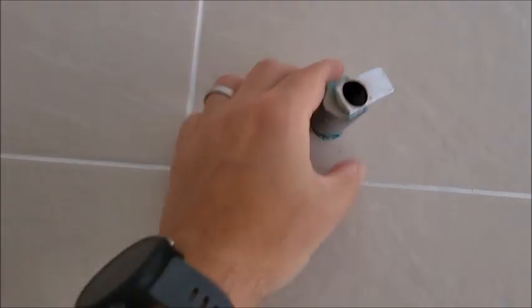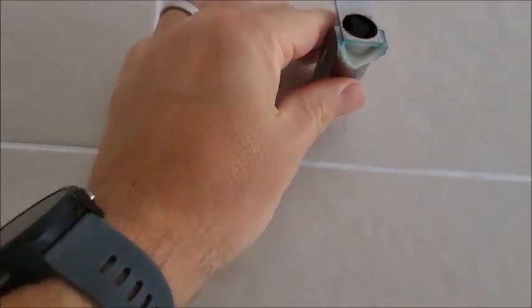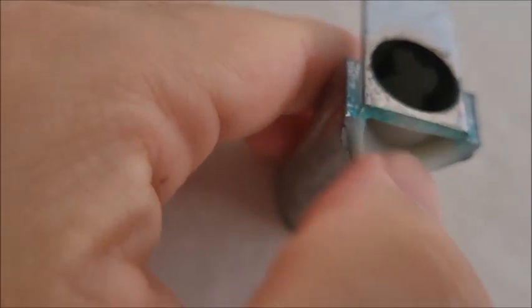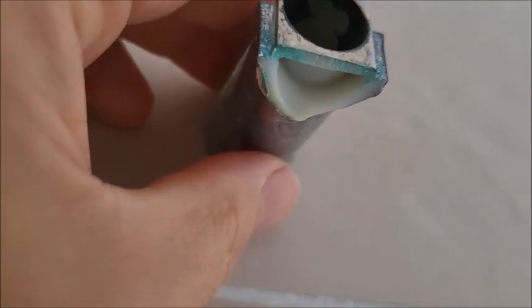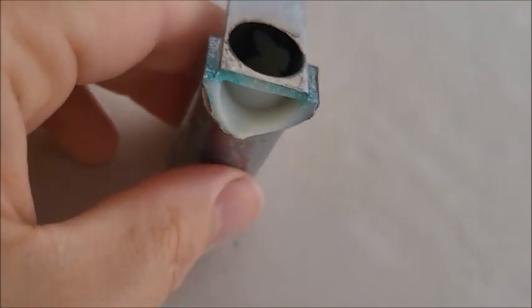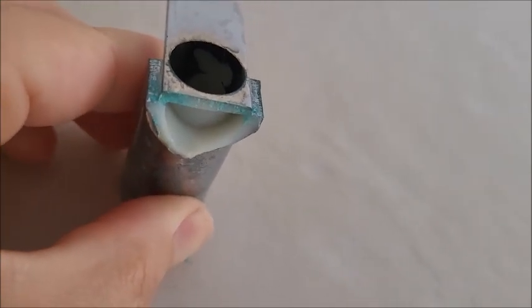I'm going to leave it in there for a couple of minutes. When it melts into a moldable shape, I'll be able to put it into the broken shower rail. I've loosened this bit here so now it can move into position — we can fill this gap with the melted plastic, stick it in, and then screw it in place. That way it should be nice and firm for a few showers yet.